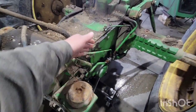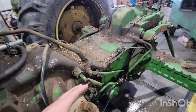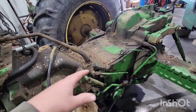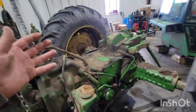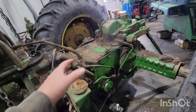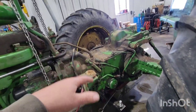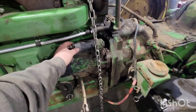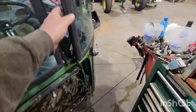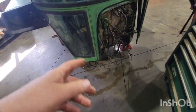You would have your air conditioning lines coming through here to some couplers, a brake line on this side, and depending on the generation of tractor you've got a steering line back here by my fingertip, then your PTO and clutch cable or rods coming down. Depending on your tractor, some of that PTO linkage is up top — kind of a pain to get to — and some of the plumbing is a little different throughout all the different 30, 40, 50, 55 soundguard cabs and models, but it's the same. Then we just start lifting the cab — the harnesses I just tuck into the cab so they're not dangling.